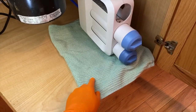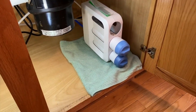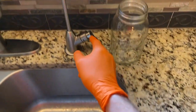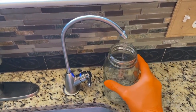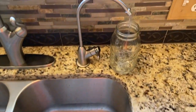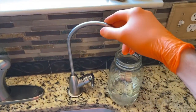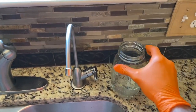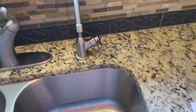I should have done this first, but I placed a towel underneath the filter case to catch any water that leaks. Back to the instructions: we are now going to open up the faucet and allow all the water to come out of the storage tank. I don't want the water just going down the drain — that's still good RO water. We're going to end up drinking this after the project. You will definitely fill up a few jars if you are using mason jars. Set that aside and leave the faucet in the full open position.